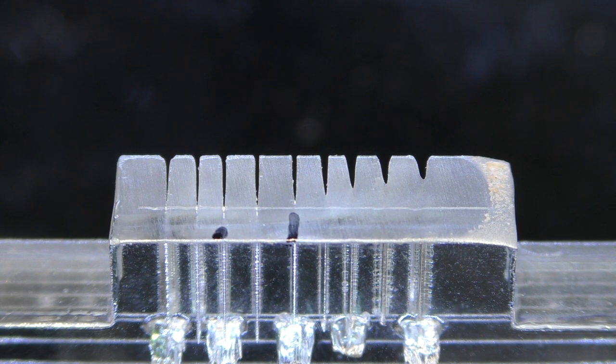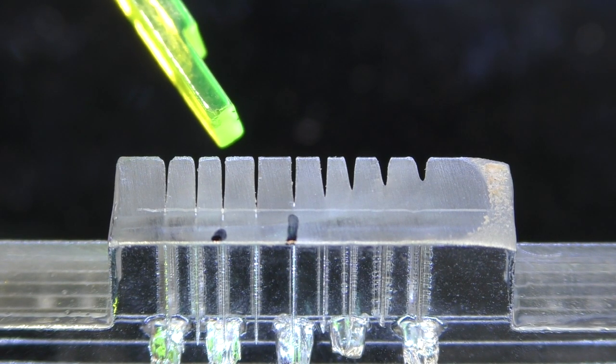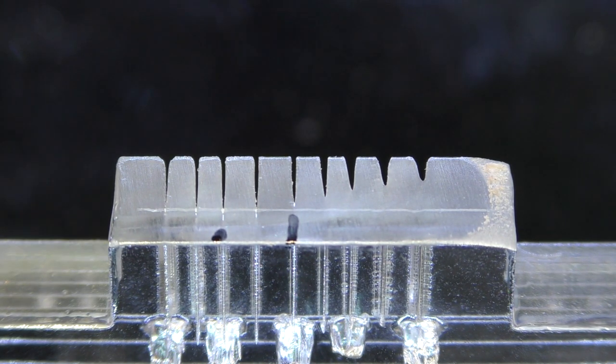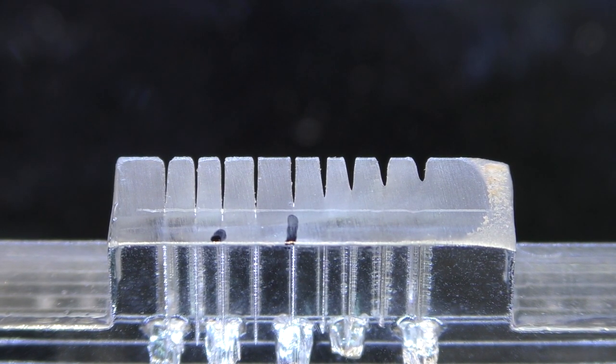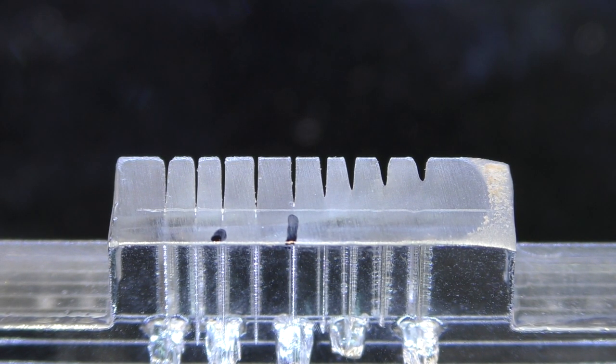Here I've got an example of a 1.5 inch lens. The deepest cut is happening at 36.1. In other words, we buried the manufacturer's focus 2 millimeters into the material. And just possibly, this may well be why people believe that they can get a deeper cut by burying the focus into the material. Now, this is true, as you can see, for some lenses, but it's not true for all lenses. It just depends where this intensity focus happens to be.